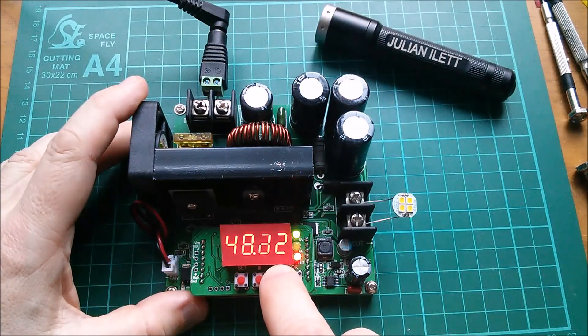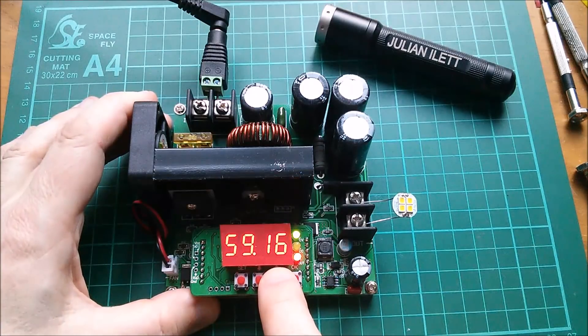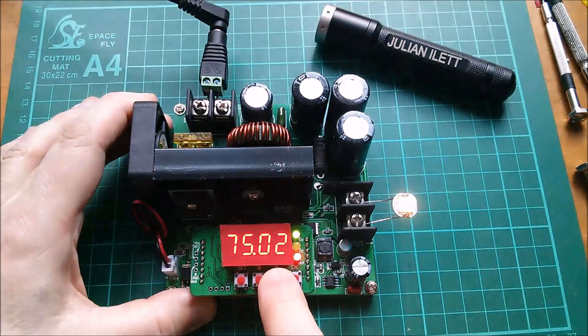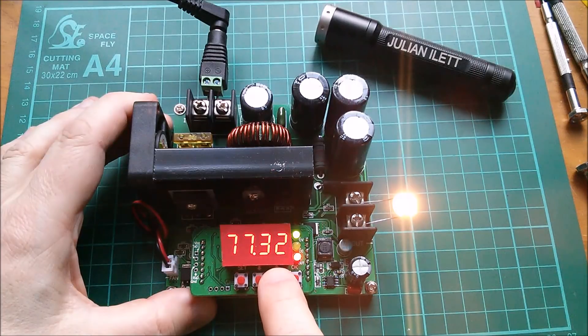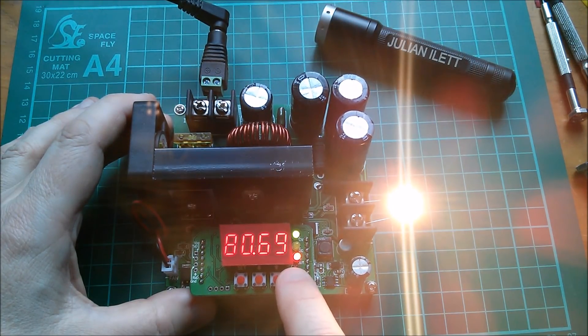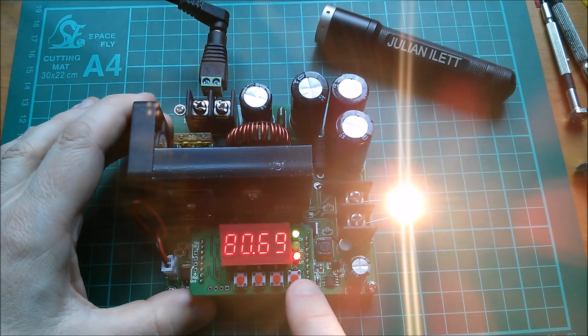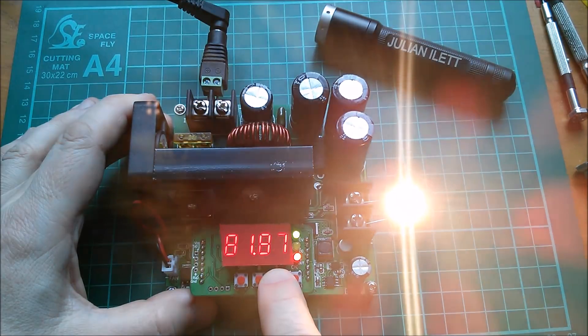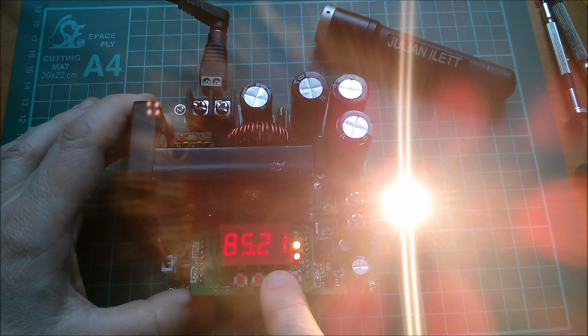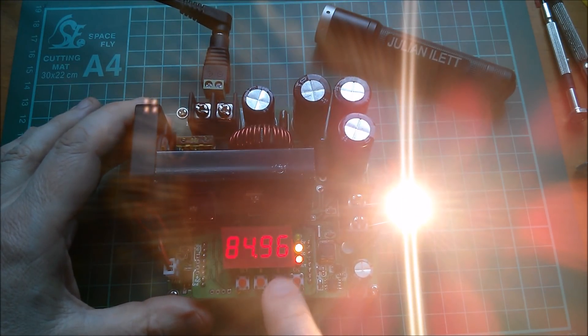My current limit should still be 20 milliamps. Did it go into current limit there? 70 volts. That's starting to come on now at 73 volts. 75 volts - yes, that's starting to light up. 77 volts. 80 volts - that's got a bit of reasonable brightness to it, but it doesn't seem to have current limited yet. The current measurement is reading zero, but it is a very coarse measurement. 84 volts - oh, that's getting quite bright. It has actually gone into current limit; the current is 20 milliamps. So that shouldn't go any higher. 85 volts - it's settled at about 85 volts, which I think is pretty remarkable.